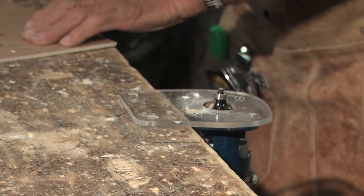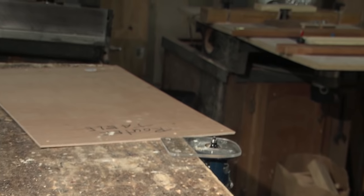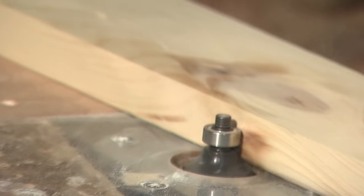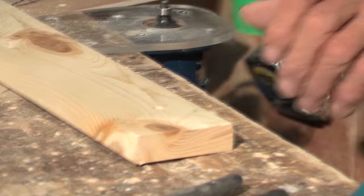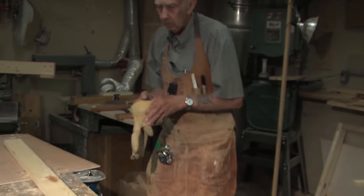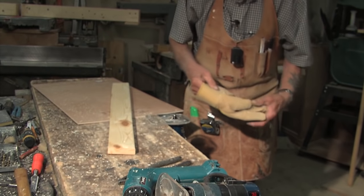So I can route this thing — it's very nice and solid. If I want longer pieces I can put them in here and route them. It's a lot better than trying to hold the wood down and run your router across it. It's more stable this way. You can do real short pieces or long pieces. For real short pieces, I'll actually wear heavy gloves because you can get close to that blade — it won't go through the gloves.